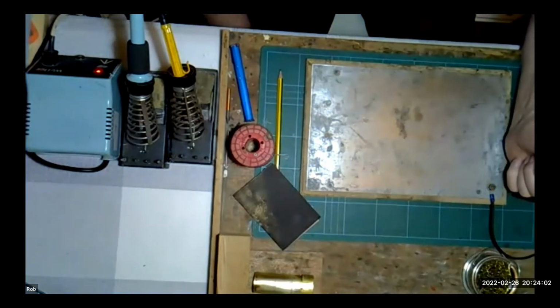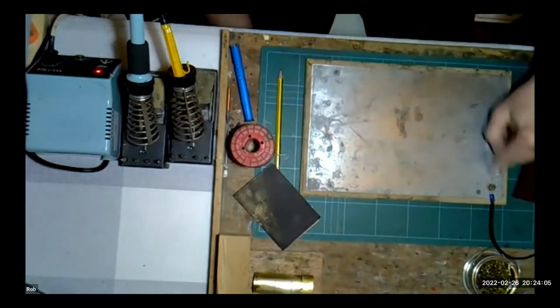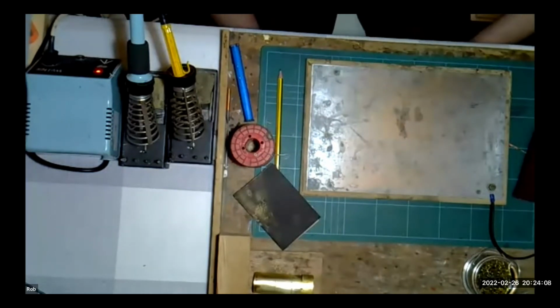Absolutely. And so where might you source such a plate? This came from one of my customers, who happen to have a car body shop. That's the sort of place you can source any steel plate like that. If you've got a local friendly car body shop, pop in and see if they've got an offcut of Zintec or something like that. The advantage with Zintec, when it's new, is it has a very fine coating of zinc over it, which prevents it from corroding. But this one I've had so long, I think the zinc's gone off it and it's starting to corrode in places. It's coming up for time to replace it. It's been around a long time.